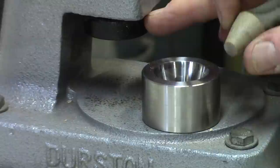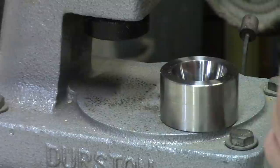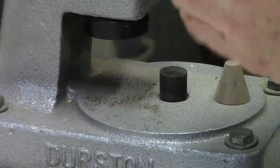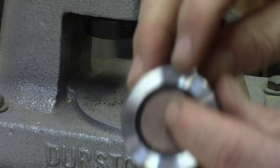If the cone is a little bit too tall to fit under here, then you can use a larger die or a smaller cone — that way you can basically make any coin that's available into a ring. I can feel it getting work hardened, so I'm going to go ahead and anneal this again and then continue folding. Fresh anneal on the coin, so it's nice and soft again. We'll see if it goes into the next size down — we'll keep it in the 1.2, maybe try one larger size cone. Looks like that will work just fine.